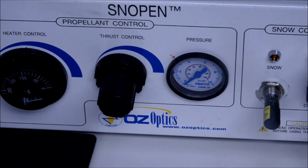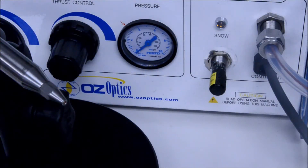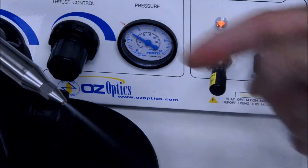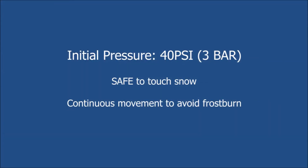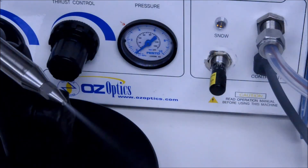We recommend having the propellant flowing while adjusting the pressure in order to see the changes in real time. Pressing the foot pedal activates the composite flow of carbon dioxide and propellant. The snow indicator light turns on when this happens. The onset of snow spray may be delayed as the liquid carbon dioxide needs to work its way through the system. If the system was not used for over an hour, a slight delay occurs before the snow starts exiting the nozzle. It is safe to touch the snow flow, but continue to move your hand around while in the flow. A frost burn may occur if you hold your hand in one position for too long. Once the pedal is released, the propellant turns off and the snow indicator light turns off. Residual carbon dioxide will continue to flow out, but this residual flow should not be used for cleaning. Subsequent activations of the snow will have little to no delay.